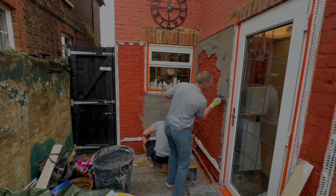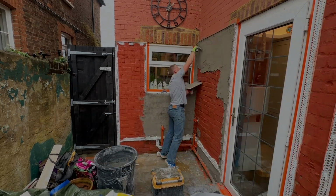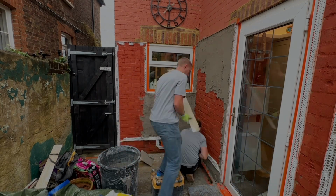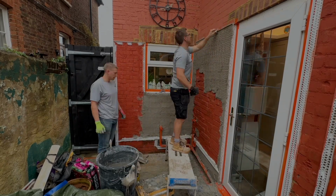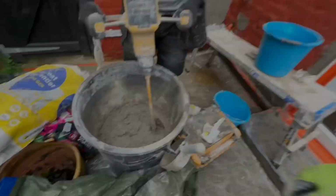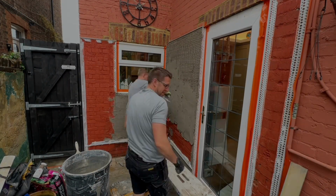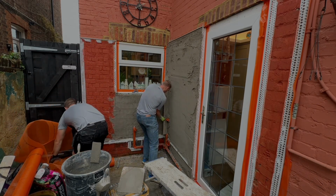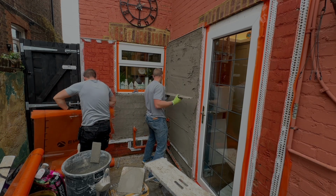As you can see, that's impressively thick, this stuff. Much thicker than under normal circumstances you would apply. However, as I did say, I've used a lot of extra SBR additive, which is an incredibly strong gluey adhesive strengthener, which will allow us to build it out much thicker than normal. Also, I will be adding 4 mechanical fixings to that section below the window because that is particularly thick. The other areas are quite thick, but not as thick as underneath the window.